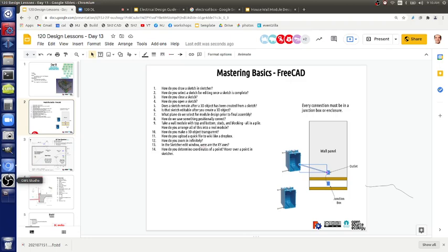Say it's on the right hand side of the left hand stud, like the middle stud. So you have to think about it. What are the dimensions there? Yeah, we know we have 14 inch cavities. 15.5. If you're measuring from the edge, then you add another 1.5. Right, because of the other stud on the outside.